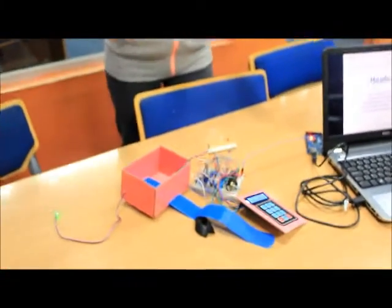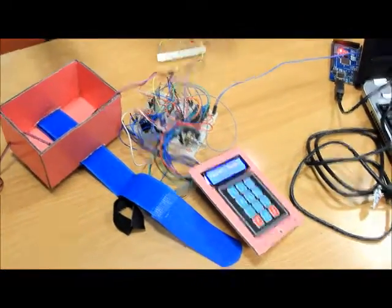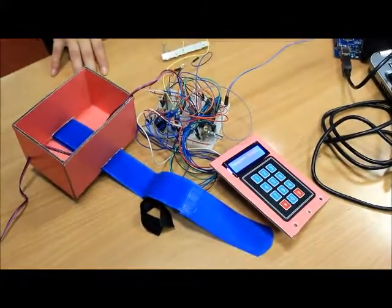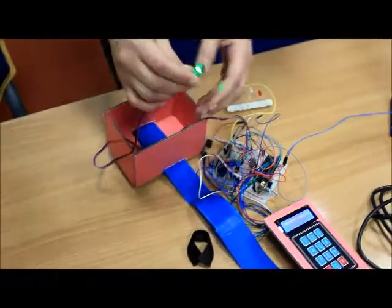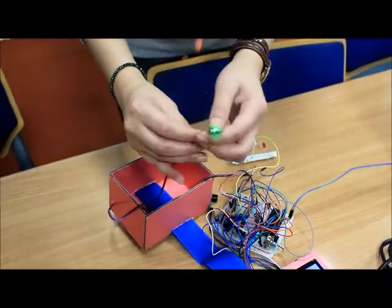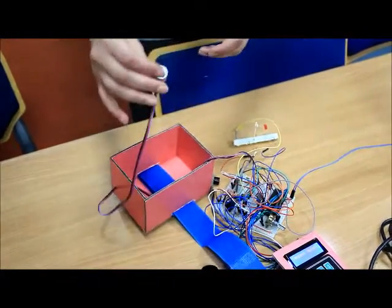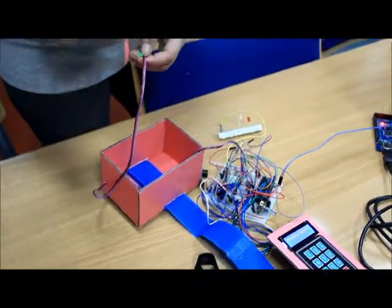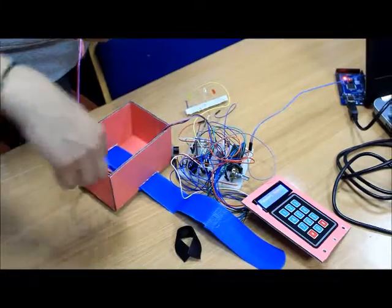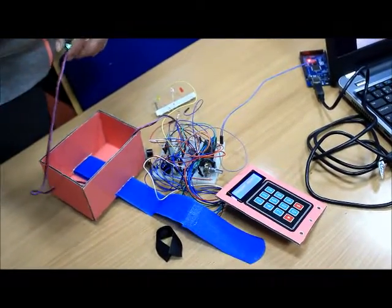I'm going to start talking about the hardware design. Our circuit uses a 16F877A microcontroller, which has five ports. For detecting the heart rate pulse, we have used the pulse sensor. It's basically an IR that has a transmitter and a receiver. The three wires are the VCC, the ground, and the purple one is the output that we connected to RB0, so we can use the external interrupt.